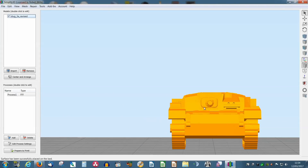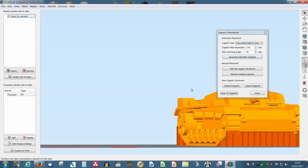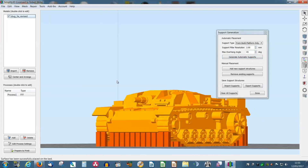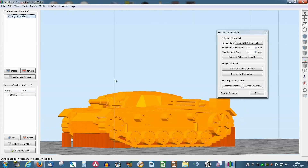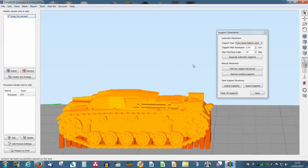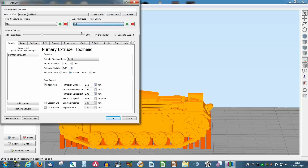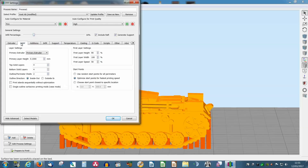Now when it comes to support material, there are various choices. I've already exported the model I'm going to print. I've discovered that 'from the build platform' is good, and 3mm — probably good, though I've gone with 2 here. Let's generate the supports. As you can see, it creates quite an impressive mesh underneath the vehicle. You've got to be careful with the printouts on something this scale for some of the overhangs. You've got a choice of fast, medium, or high — for this one I'm going to do high with less than 20% infill. I don't think you need a huge amount of infill.